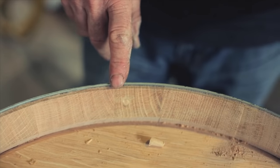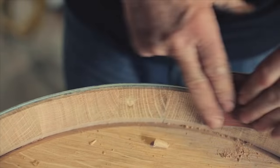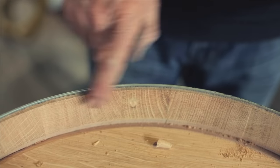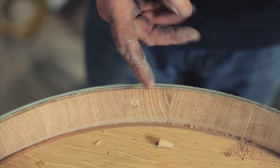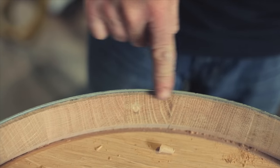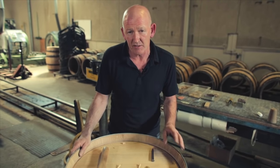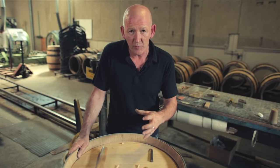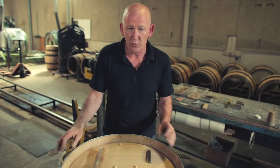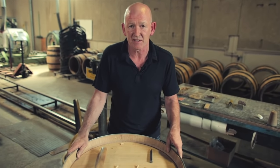One side then the other. Once it's off, we're going to use some sandpaper to smooth it over. Anywhere you scrape wood, you open the pores, so we always use some sandpaper to close the pores back up on the end of the stave. After sandpapering the wood to make it all nice and smooth, I'm going to check the rest of the barrel, because now the pressure is wanting to find another weak spot. If there's another weak spot in the barrel, we'll show you how to fix that too.